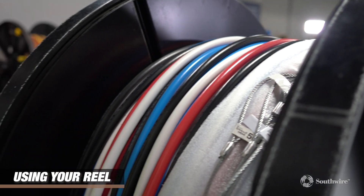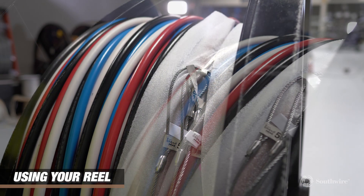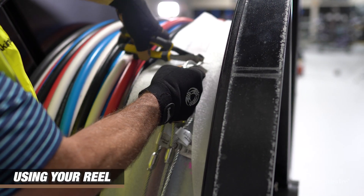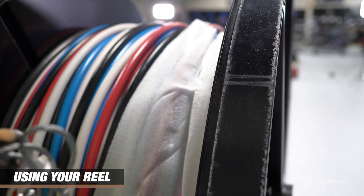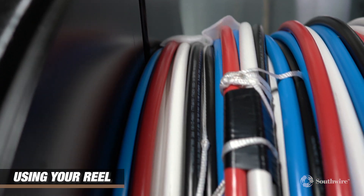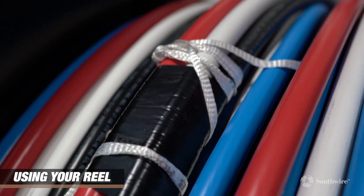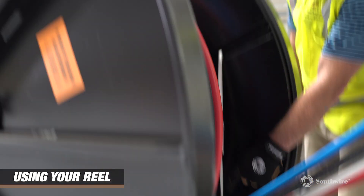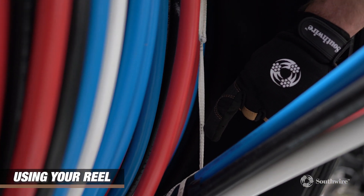If your order includes pulling heads, locate the beginning of the pull by looking for the white foam. The pulling head will be tied together with a rope. Cut this rope with a pair of side-cutting pliers or similar pliers to free the heads. Please note that there might be two tie ropes, and you should not start pulling the cable until both are free. Look for another rope tie about 10 feet after the heads, cut it, and remove the tape if any.